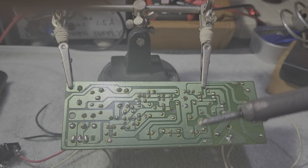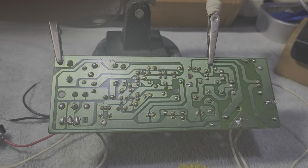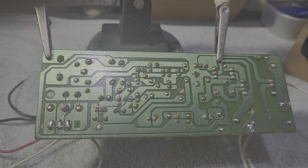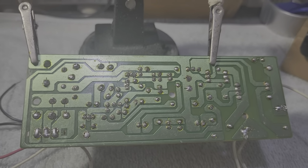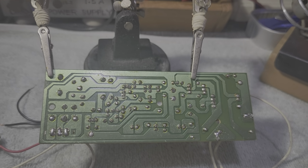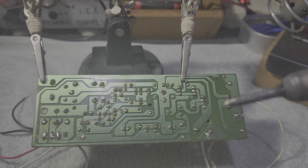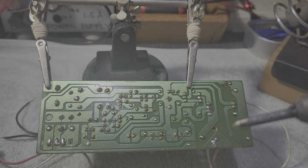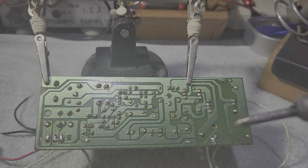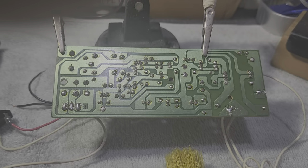It is this. Okay? Make it a point that when you try to reheat the solders, try to avoid solders which contact the other solder terminals because that will be a short circuit. So we will be using a soldering gun in which the point will be, if possible, pointed. So the contact at the point of solder is actually minimal with respect to the other solder terminals to avoid the so-called short circuit condition.